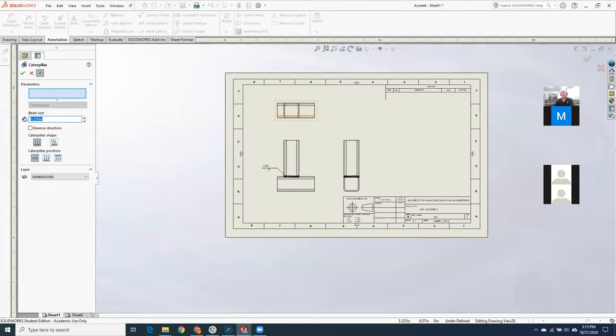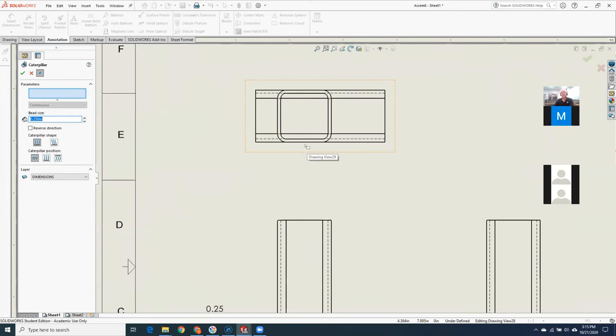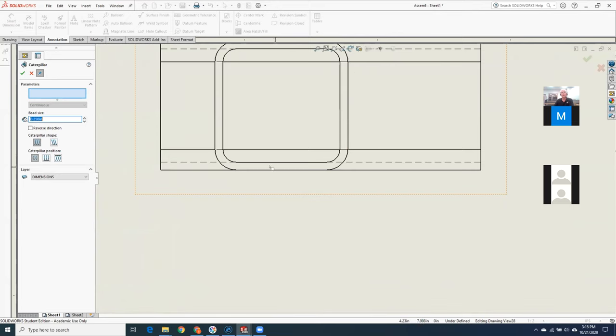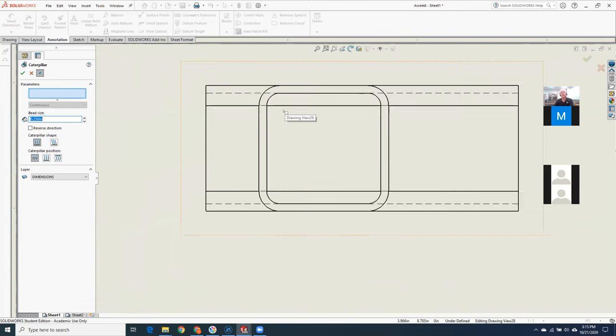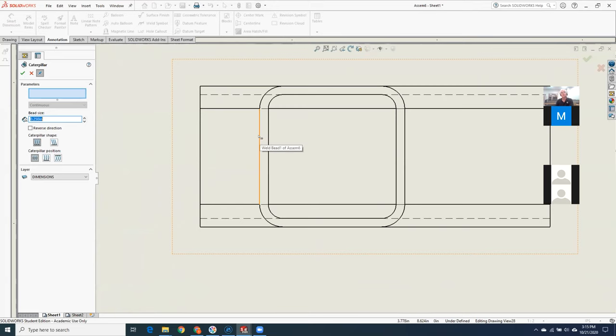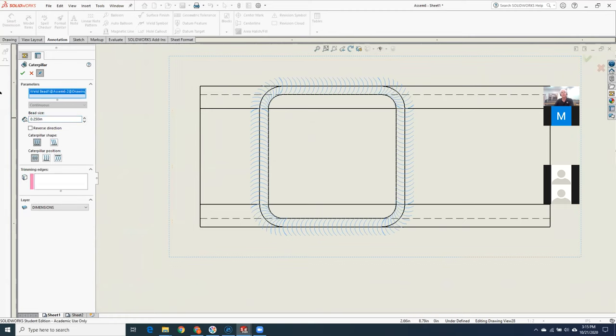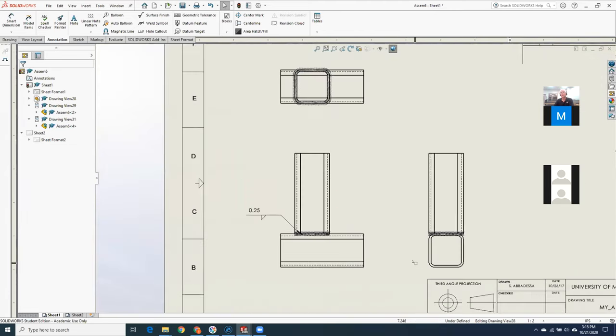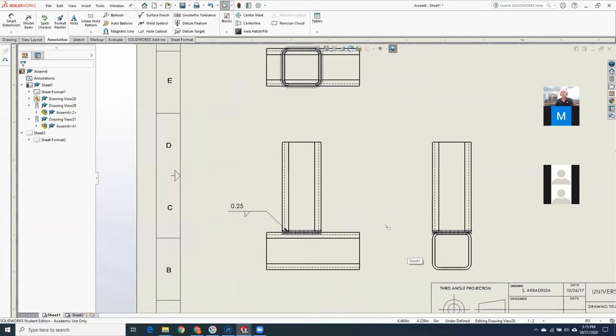If you go to the top view and try to do it, when I was prepping for this lecture, I had some trouble with this this morning. So I want to show you how I get around it. The problem is these edges are all visible on the top and they're sitting, oh, the weld bead is actually showing through on this one. Okay. So let's just point to weld bead 1 of SM6. Click on it. Huh. That was not working this morning, but it decided to work now. Okay. So rather than having an actual graphical globby kind of weld, we put these little caterpillars on, and that represents the weld bead. Okay, so that's pretty jazzy.